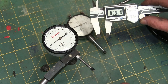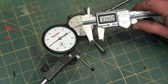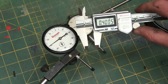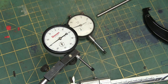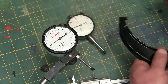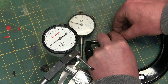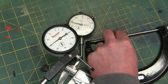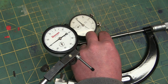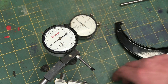These are calipers. Some people believe these are super accurate — it depends on the kind of work you're doing. If you're mangling dead tree carcasses, chances are this will get you where you need to be. Most of the time with what I'm doing, good enough. If you need it more accurate, you're gonna need some micrometers. Beautiful set here with the four-inch standard, and it's actually got a ratcheting mechanism to ensure — it's about 18 degrees centigrade here in the shop — and the standard is dead nuts on four inches. 4.000 inches. Dead nuts on.